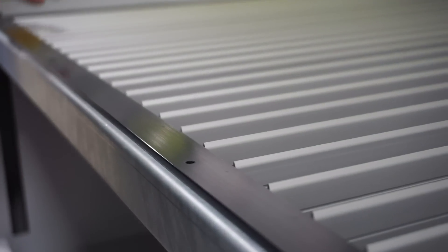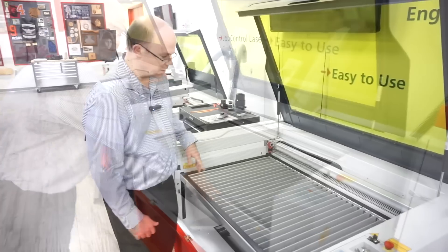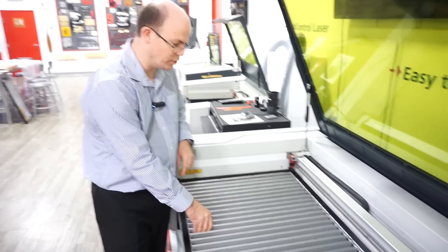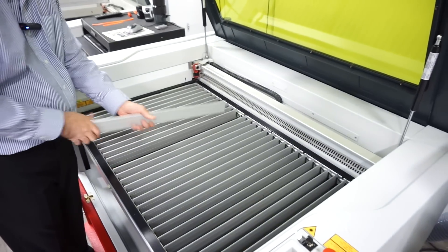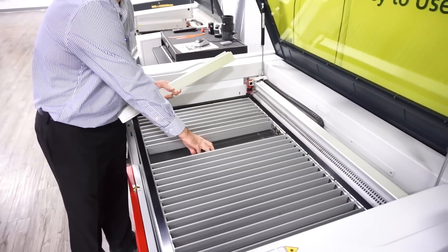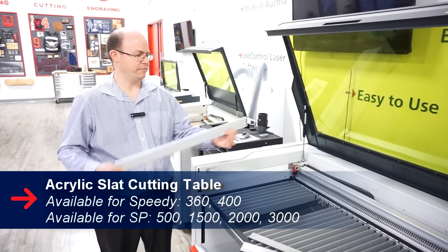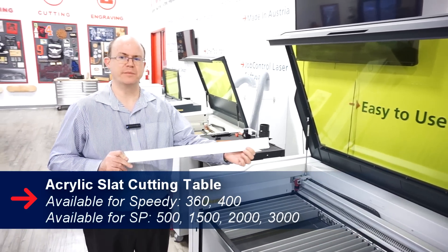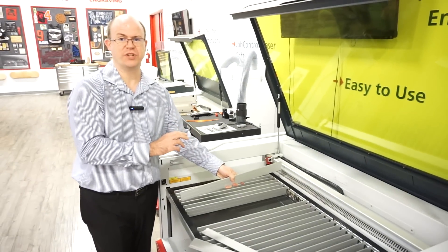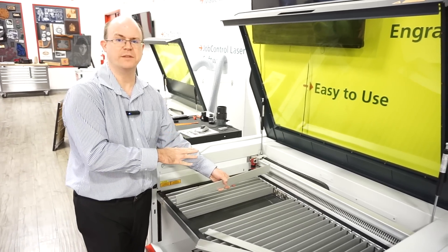Now that we have the border in place, it will prevent us from scratching the back side of the material as we slide it into the table. If you're cutting through thicker materials and you're still having back reflections, you can actually remove slats in the area where the back reflection is occurring. When the piece cuts out, it'll just fall down onto the main base frame table. The acrylic slat table has slats that are exactly the same dimensions as the aluminum slats. The bonus is that when they're in, they don't back-reflect any laser energy at all, so you get perfect cuts. The downside is they're consumable, so they need to be replaced.